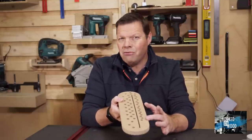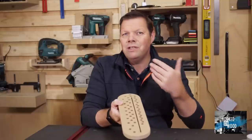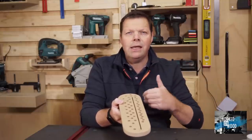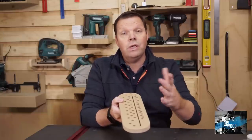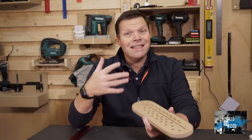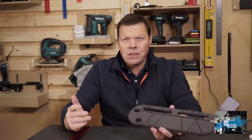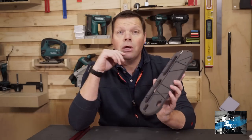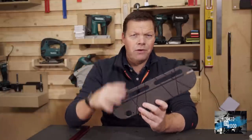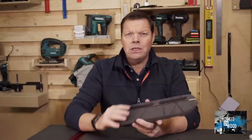The holes in the back have minimum effect, but you want to leave them open because your system can't extract more air than the air it can extract. So to increase your air inlet is to increase your dust extraction. With this information I made a lot of different designs, and I ended up with one design that was the most effective. So it was not just about making holes in your insert — the design certainly makes a difference.